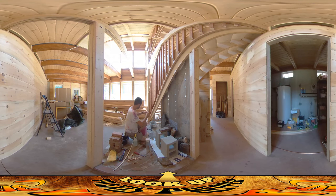Like I said in an earlier video, I can only do one course at a time. I've got a piece that's actually ready to go right in here, but I don't want to be putting weight on this stone until that one's all set in place. So the next one is over here — and the first step is just from yesterday: give it a nice wetting so that the concrete gets a nice bond to it.